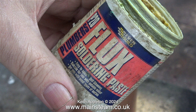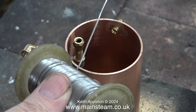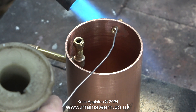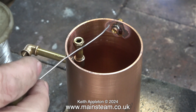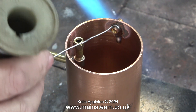I've had this tub of flux for years because I don't use very much of it, although I have used it a lot over the years for making condensers — I used to make and sell condenser oil traps for model steamboats commercially. I'm brushing some flux around the areas where I want to soft solder. The soft solder I'm using is multicore soft solder with an inner flux core made of some sort of resin, so it's a belt-and-braces approach. It's most important that all the parts you're soldering are clean — and although soft solder can appear silver in colour, it is entirely different to silver solder, with a much lower melting point.